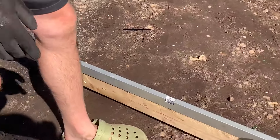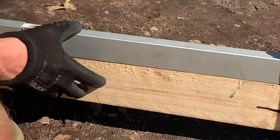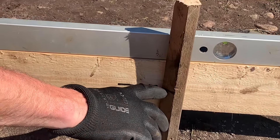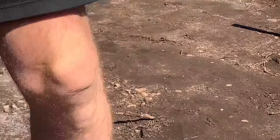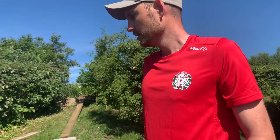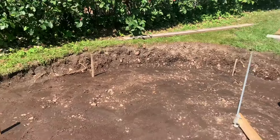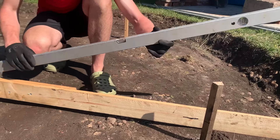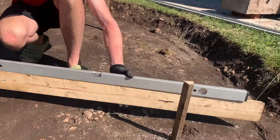To get the right level I have prepared sticks with a mark, and I checked from the level and put the line on them so I can see all the way around that I get the right height. I'm going to do it in steps of a few centimeters, compact it, and then a few centimeters more. I'm going to use the water level and spin it around so I get everything level.